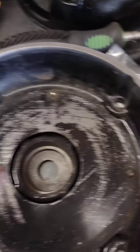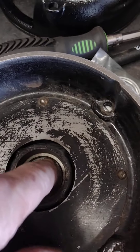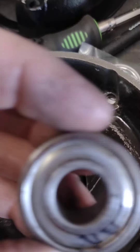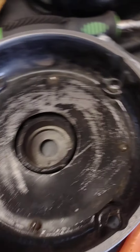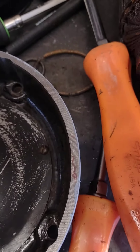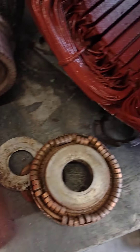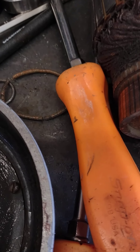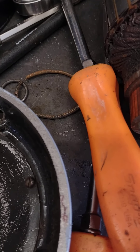Well, if you'll notice, the original is shielded on both sides — but no, the replacement has no shielding on one side. Dirty and cheap. So the plan is to put the open side facing down to try to keep crap out of there. I don't know if I can come up with something to make a shield out of, but I'm not gonna try to pry that shield out of there and reuse it — that would be a freaking fiasco. Anyway, this is where I'm at. I'm gonna clean this up, and once I get it cleaned up we'll see if the spring holds or not. If it doesn't, it's gonna be go to a bearing place and watch their face fall.